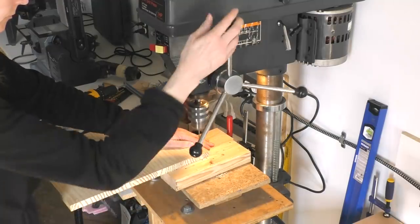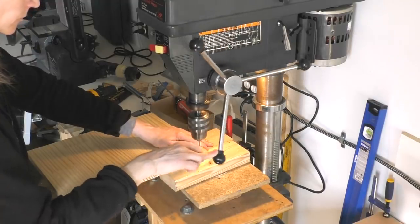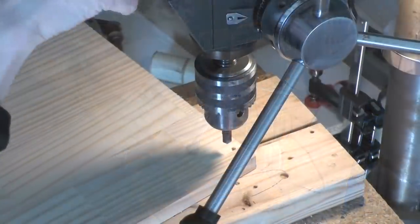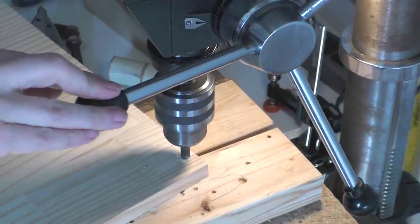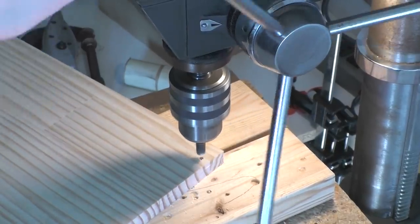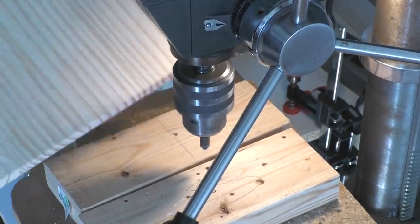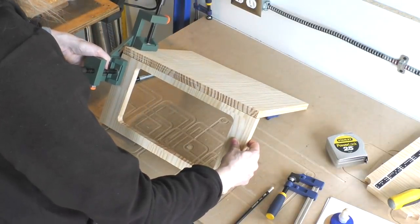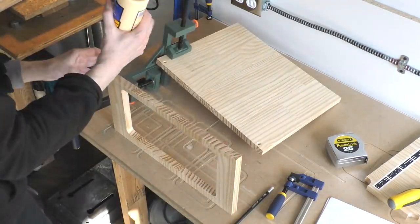After I've got two screw holes drilled in the top board, I change out the drill bit for a countersink bit and put a couple of countersinks so the screw heads will be flush. I really like the countersink look. I'm using a special 90-degree vise—once I've put glue down, I just drop the assembly in the vise, clamp it in, and it's a really quick way of aligning everything and keeping it at 90 degrees.